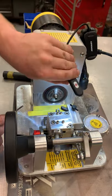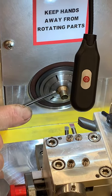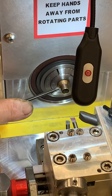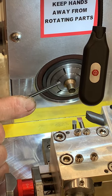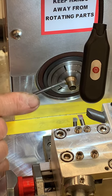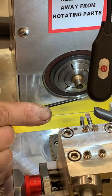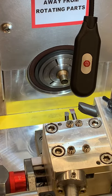Let's talk quickly about case fitment. If you get your case holders from us — which most of you do — the body-shoulder junction should be basically flush with the end of the case holder or slightly past. The reason for that is: the more the case hangs out of the case holder, any run-out you have in your case body-to-neck is going to be projected. If you're holding it here and you've got a thousandth of run-out, that will clean up fine, but if it's hanging out here you may get two to three thousandths and it won't clean up.